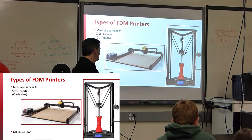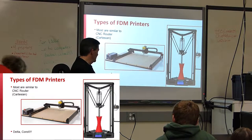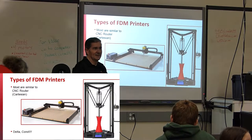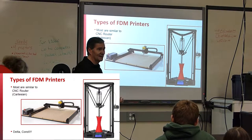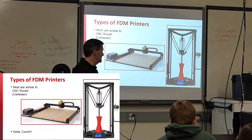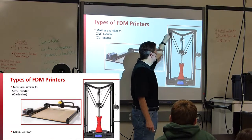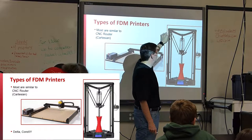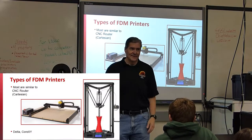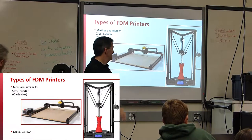It's very easy to see here the X axis, right here. So I can move the print head along the X axis right here. The X gantry can move along the Y axis this way, so it can get that dimension. And then there's a little motor that moves up and down this way, so you get the Z dimension. So it's a whole Cartesian setup. Now, there are other kinds, but they're not used as often. There's this one over here that I pictured called a Delta printer, and it's a fascinating setup in that you have three controls, and they put them in these triangle corners here, and they tend to go up and down, and you have kind of a four-bar system from these up and down points to control the print head in the middle, so it allows it to move all around. It takes more calculations to figure out how to move the print head around to do your printing, but that is the Delta ones.